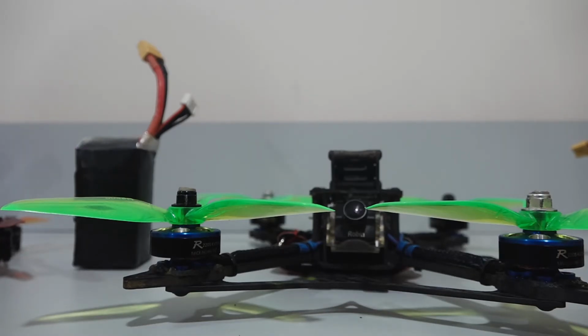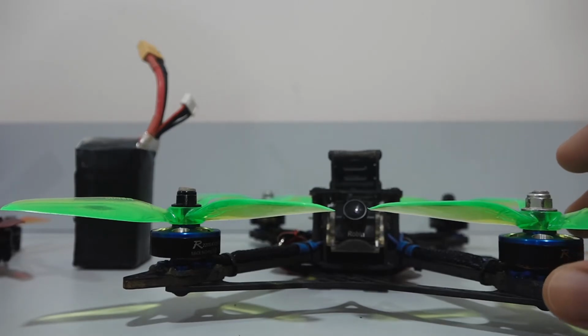Another thing you might have noticed is that we did not consider other components on the drone. We only looked at the motor current requirements and calculated the battery required. There is a reason why we did that: an amount of current like 30 amperes is drawn by the motors, and compared to that anything else is negligible. But to be on the safer side, you can always add 1 or 2 amps to the calculation.